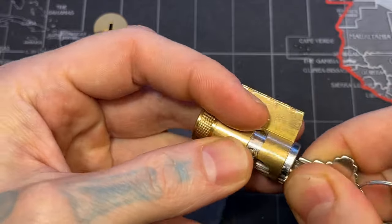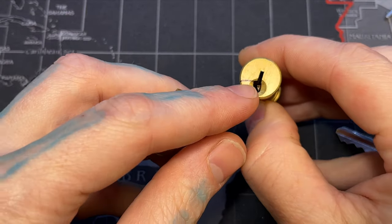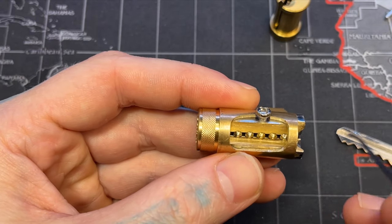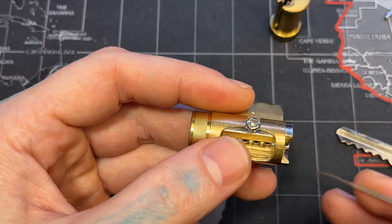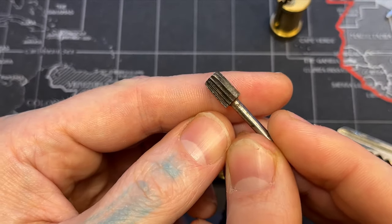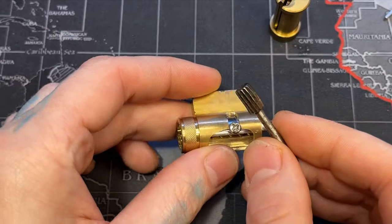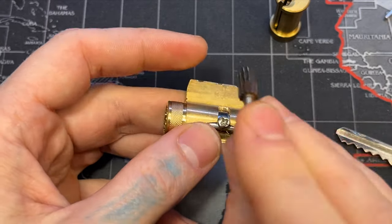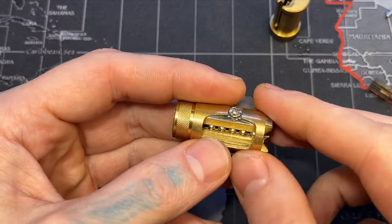To drill the hole through the body, first this was easy — just a saw. Take a saw, cut it off on the side, and file down that little piece right there. All I did was take a drill, drilled two holes, then took a Dremel and did the rest. Brass is pretty soft and easy to go through. The type of bit I used was a burr bit — all metal, so you don't need any sanding bit. A sanding bit works fine, but you're wasting your sanding on that. I took some 220 grit paper to kind of smooth it out.